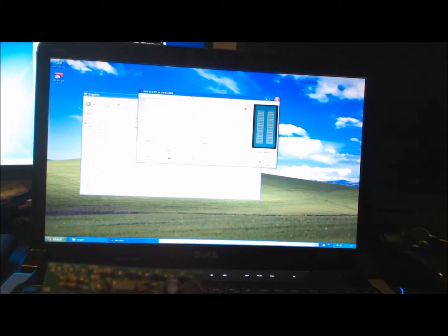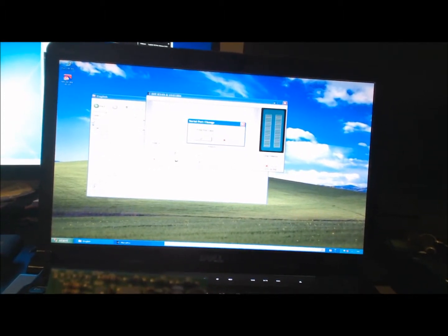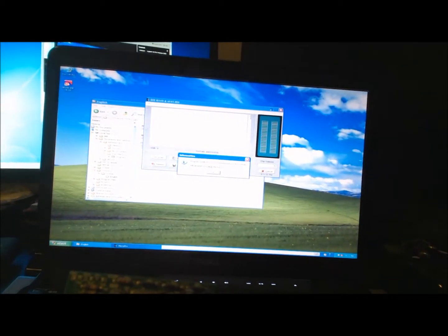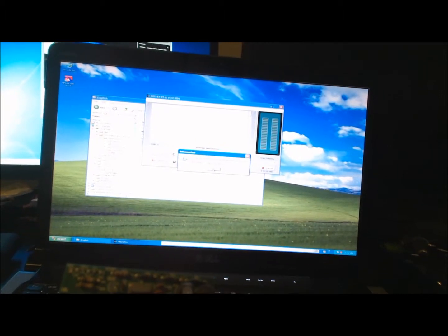We got a message saying that it couldn't work. So what we'll do is go to port. We'll change the port to 3. Basically in here you're selecting the COM port that the device has been installed with. So for me it's COM port 3. Just look in your control panel, it'll all be there. COM port 3, and there we go. Program mode equals K. You should get this pop-up. Probably can't see it, but it says program mode equals K149A. Connected board equals K149-BC.